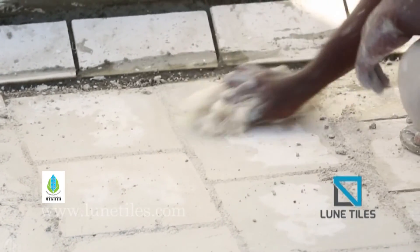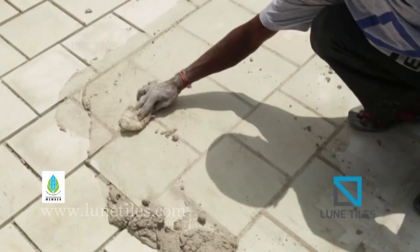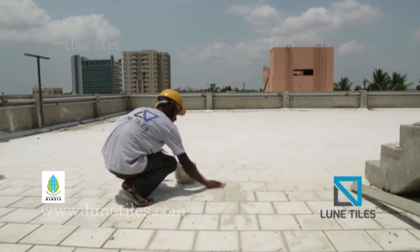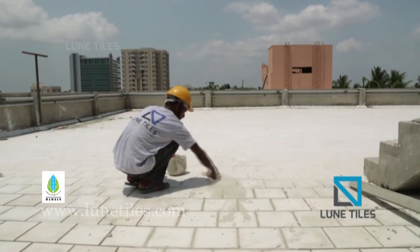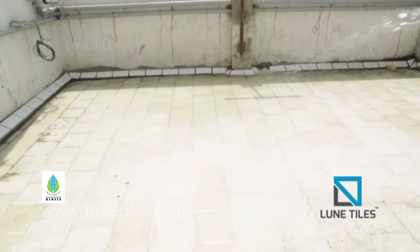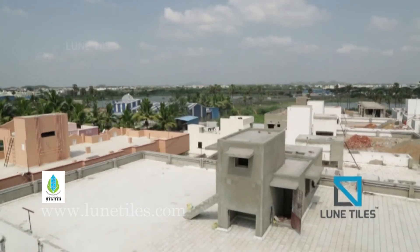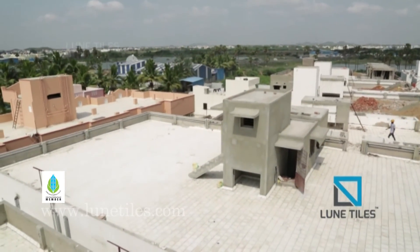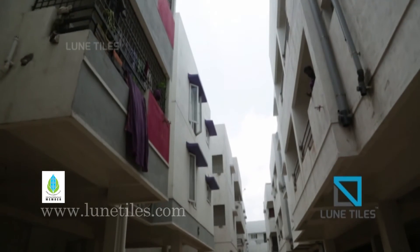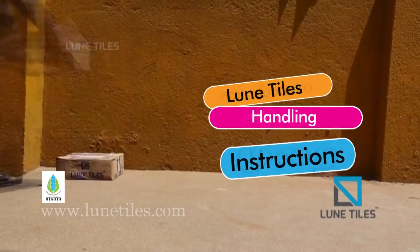After an hour, once the surface gets dry, clean the surface using a wet cloth to remove excess soft mortar mix. Again, clean the entire terrace area using a wet cloth for a neat, clean terrace. Pour water 2 times a day during morning and evening for about 2 days on the terrace. After that, it is advisable to store water for 2 days on the terrace. To avoid the formation of cracks and to obtain a neat surface, you can eliminate heat convection and water seepages on your terrace by following the above 3 simple steps.